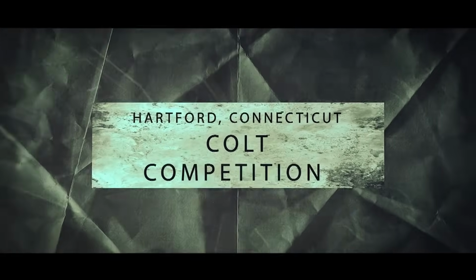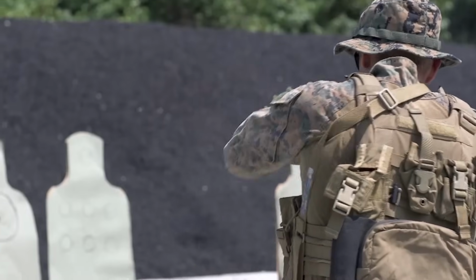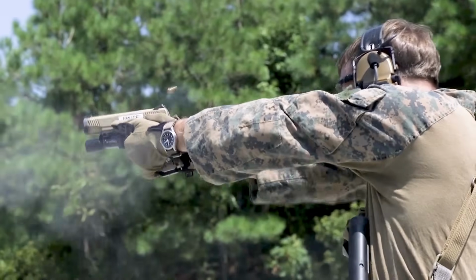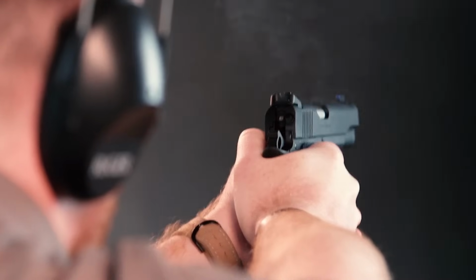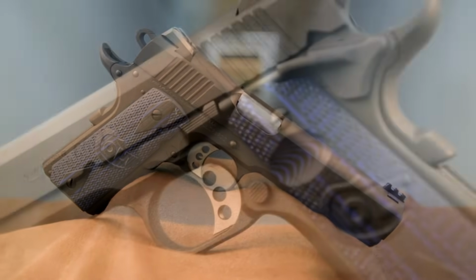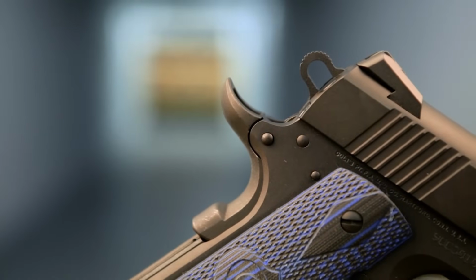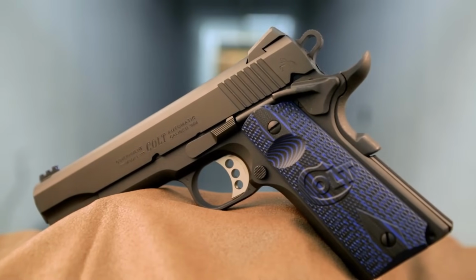We looked back just a few years at the M45, and what we realized real quickly was the M45's adoption by the Marine Corps in 2012 really gave us an opportunity to take a 1911 and figure out what features made sense now. That pistol was incredibly accurate. Ergonomically, we did an undercut trigger guard so you can get higher on the pistol and have more leverage on the gun. It also had an upswept and appropriate beavertail for today's shooter. We extended the thumb safety and used serrations from the Marine Corps pistol.